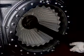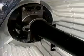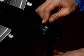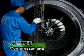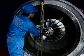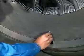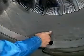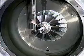Center the rotor by adjusting the pulley of the guide piece. Insert the pin at the end of the extension tube to protect the rotor from sliding out. Lift the rotor slightly with the chain block and check that the rotor turns smoothly. Screw the puller bolts at the three positions, then press off the partition wall evenly.